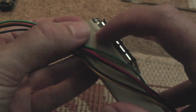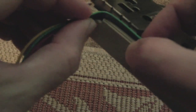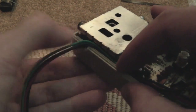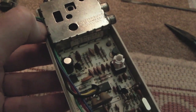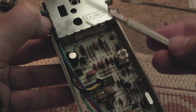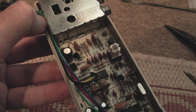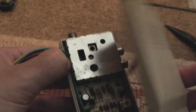I've cut a small hole out here — it's not very clean but I can file that down later. I can slide the wires one by one into that cavity and route them so they all come out and the lid goes back on without anything being compressed or restricted. It could do with a grommet there. I tested it and it still works as a normal modulator. I did isolate the connections to check if having the modulator in parallel with the outputs made any difference to picture quality — there's certainly no visible difference.